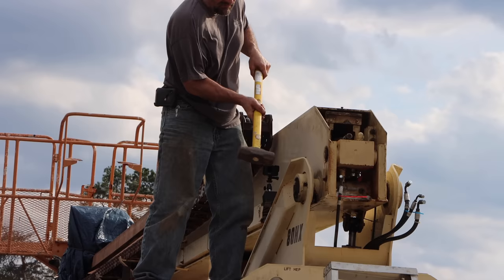So I put the boom down so that it was suspended just over the dump truck and started pulling again. It didn't seem to want to come out though. You'll see here that the fly boom starts sliding in the mid boom, which is not what I want. So I chained them together to prevent that from happening. But it still didn't want to come out.